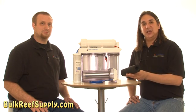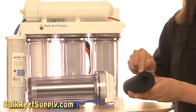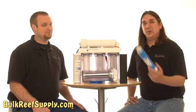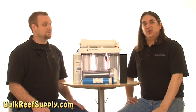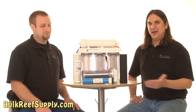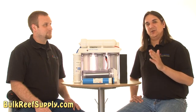I've disassembled the carbon block so you can get a better look at what it looks like and the way that it works. Water passes through the sides of the carbon block to be purified, and then it exits out of the top through the center hole, where it travels on to the next stage. Now that all the sediment and chlorine has been removed from the water, it's ready for the RO membrane stage, which is up top here. The RO membrane is going to do the vast majority of the work at removing all the dissolved solids — a good functioning RO membrane should remove somewhere between 96 and 98 percent of the total dissolved solids.